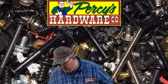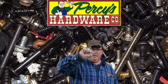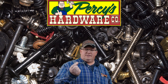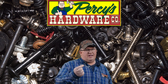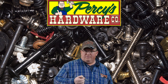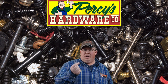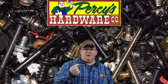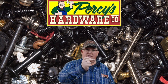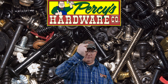Get your regular lag bolt — this one happens to be galvanized so it's decent for outdoor use. The challenge with these is they break easy. It's kind of like a grade 3 bolt. Your standard bolt's a grade 5 bolt, like an automotive type bolt. This is a grade 3 bolt so it breaks easy. Same thing with carriage screws — they're lightweight, they don't really take abuse. So when you're trying to attach two boards together and you're screwing this in, they tend to break. That's frustrating, especially when you don't want to have 100 holes for no reason.